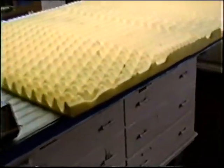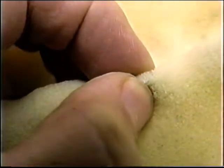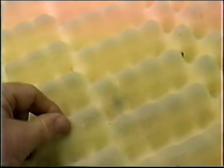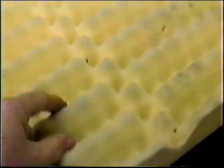Now tonight I got a couple hours, and I thought I'd lay out one of the parts, the tail cone of the nacelles. And as I took this pad up, one of the things I wanted to show, whoops, here's one right here. See what happens? There's a hard spot here, and I just keep picking them off, because what they'll do is when the wing has got a final sanding, they'll be rough on it. Now, of course, what you do is when one side gets unusable, you flip it over, use the other side, or just use the back of it.